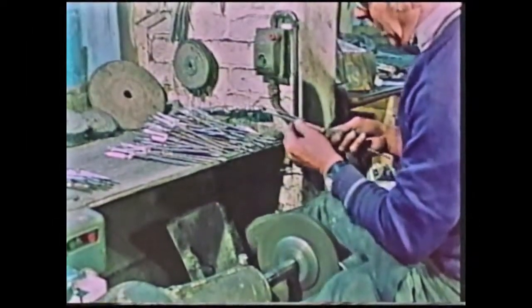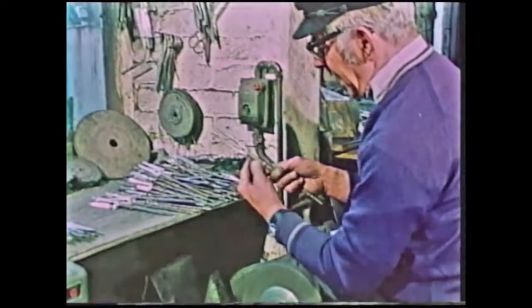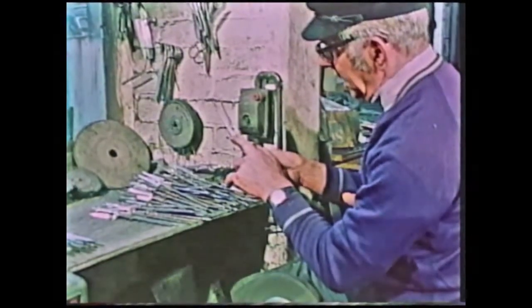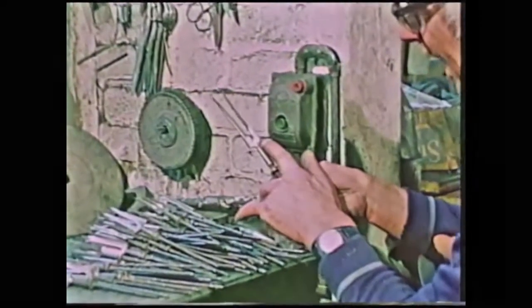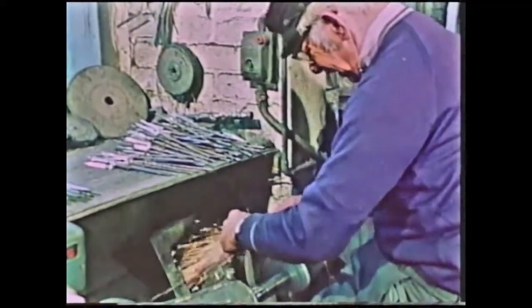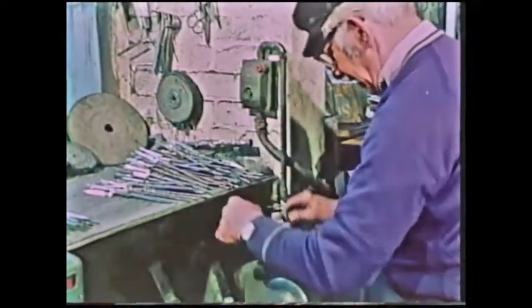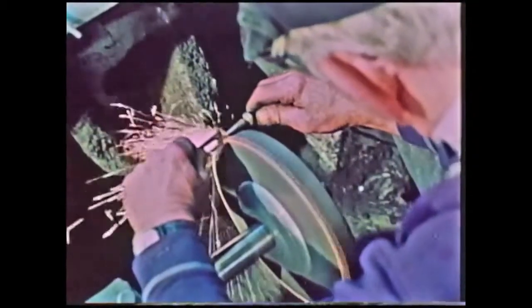After grinding the prongs, we have to remove all forging marks from the shank. And there again, keeping it exactly in a symmetrical shape. As you can see, this one side is stamped much higher than that one. So therefore, the stone has to be brought into play, bringing it dead level with each other. After the first lay, which causes it to come level, as you can see there, then we keep the shank perfectly round, ready for the next process of smoothing down.